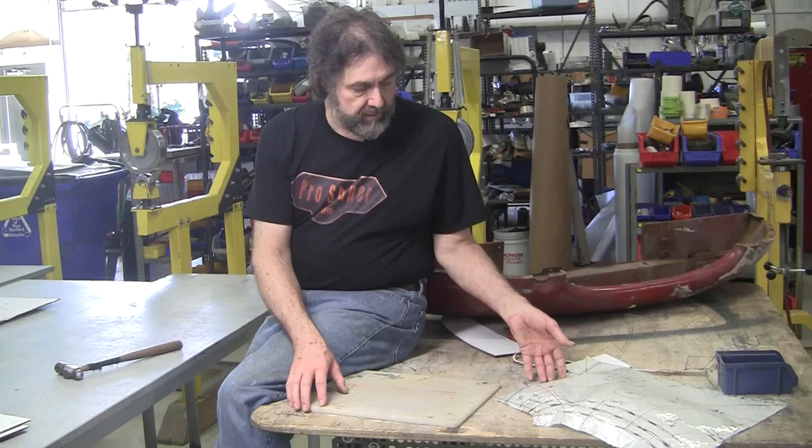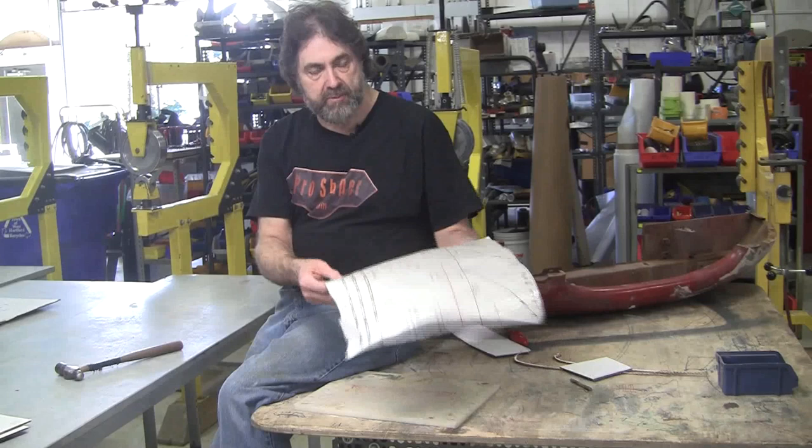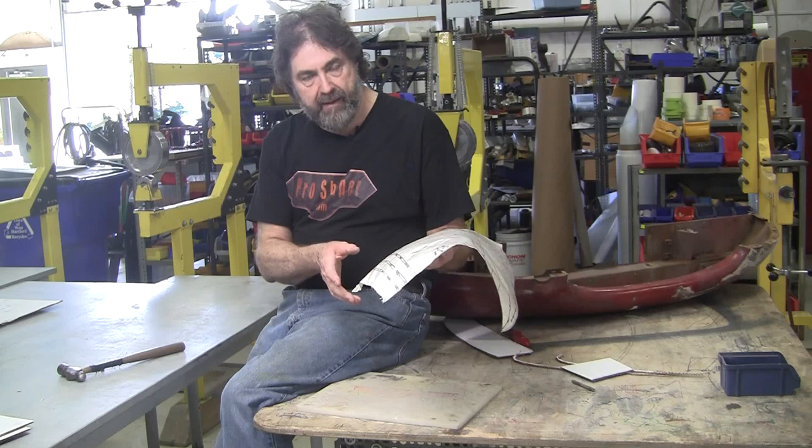They did some stretching and planishing, and then they got ready to do the roll. That's setting the arrangement. So primary is always doing the area value first. That's what the flexible shape pattern tells you, the area value, and the gauges give you the arrangement value, the bending of it. So you have to get the area value first. So they got the area value really nice.